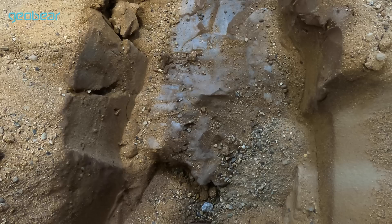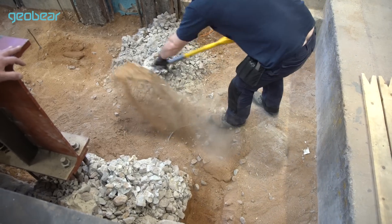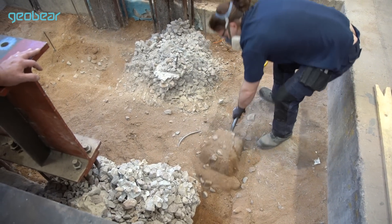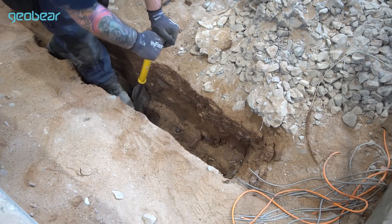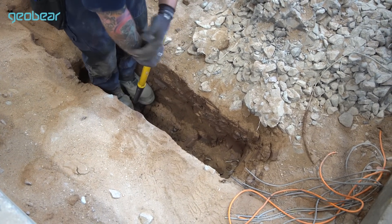It works a little bit like the reinforcement you put into concrete to give it tensile strength which it wouldn't otherwise have had. Today we've been excavating the clay test pit, and what we're interested to find out is the nature of the actual fracturing of the clay that the geopolymer does to strengthen it. Geopolymer works by strengthening the clay through fracturing and migration of geopolymer along those fractures.